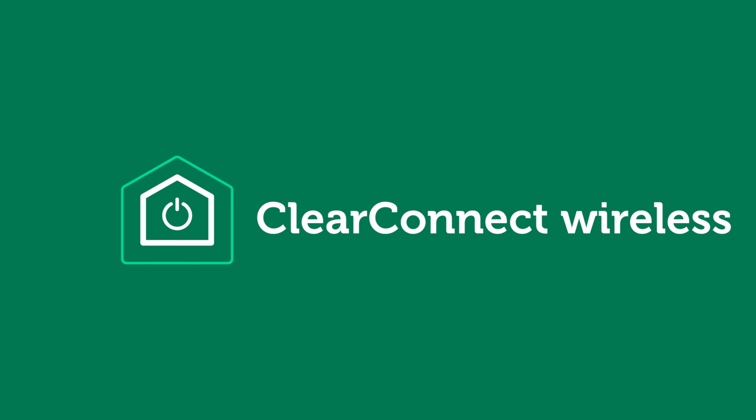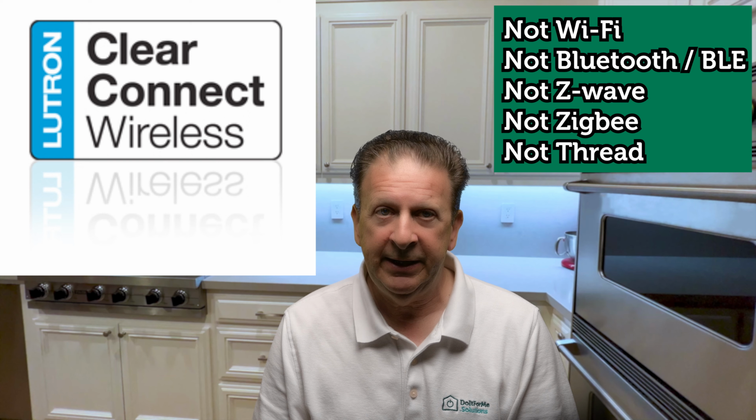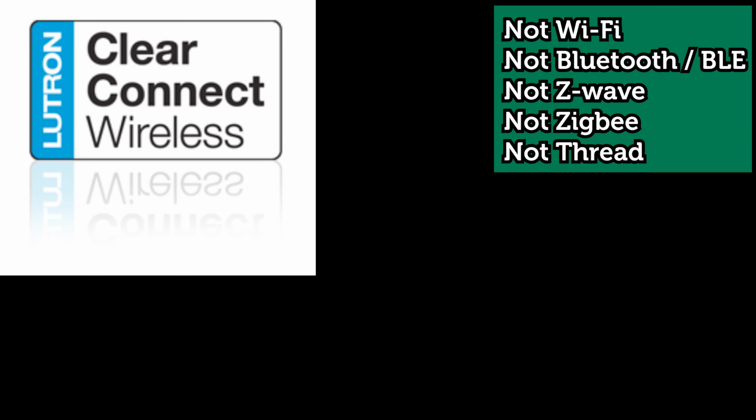Caseta also uses Lutron's proprietary Clear Connect wireless technology. This is an RF transmission system that runs in the 433 megahertz frequency range. Being lower frequency than Wi-Fi, Z-Wave, Zigbee, Bluetooth, or Thread radios, which all share the crowded 2.4 gigahertz spectrum, Clear Connect has greater range with less wireless interference.